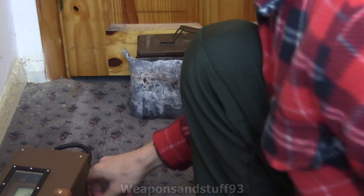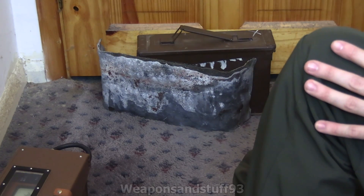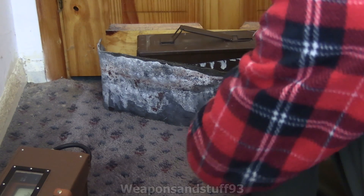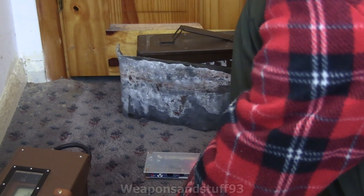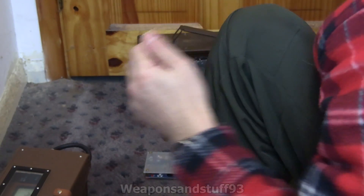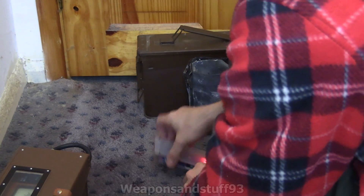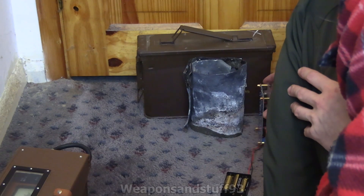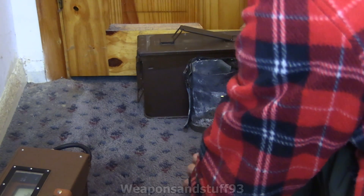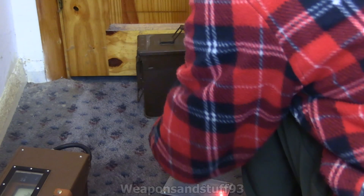Let's pull the lead shielding away again. Let's put the lead shielding like this. I know this isn't going to be a perfect example, but let's first lift it up to this bit where there's no lead shielding - that's the clicking. Let's put it on some lead shielding - notice there's not much difference. Now we're going to fold the lead shielding like that, so there's a lot more lead shielding and also a bit of dead space in between. If we put the Geiger tube there, you should notice the ticking is quite a bit lower. It's still actually fairly hot, but this should be getting across my message that you can't just rely on a little tiny bit of lead. People sometimes say in a disaster scenario you just put some lead on you and it would stop it - it doesn't work like that.